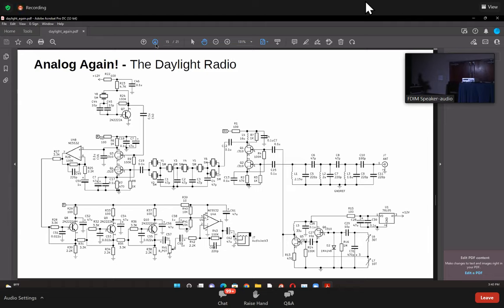You remember that a lot of direct conversion receivers, or even regular receivers, for a long time used a common base audio preamplifier, which was probably invented by Roy, W7EL, and we've been following that for a long time. It's biased with just 0.5 milliamperes of current, because only at 0.5 milliamperes will it exactly give a 50 ohm impedance, which is required for it to be matched with the diode mixer being used as a demodulator. If you don't do that, the diode mixer does not like it. It starts distorting, the IP3 falls, et cetera, et cetera.